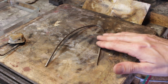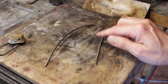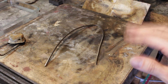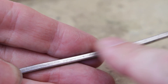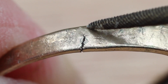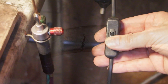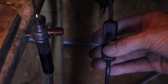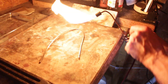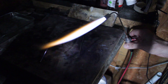To anneal this bar of sterling silver, the method is to heat the piece up to cherry red, let it cool down in the air for a few seconds to black heat, and then quench in water. The mistake most people make is to overheat it — especially with gold alloys, overheating can make them even more brittle than they started. So the best advice is to always anneal in the dark and use a big, soft flame. We're not trying to melt it, and we don't want fire scale from overheating.